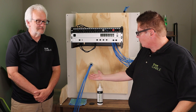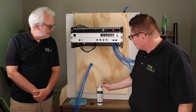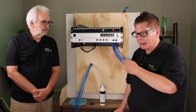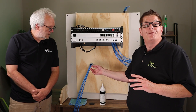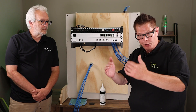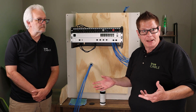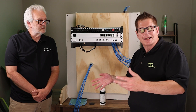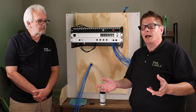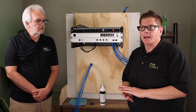So there you have it — we just demonstrated pulling some cabling through conduit. It was a small conduit, but good for demonstration purposes. The main thing was to introduce you to our synthetic cable lubricant, which is critical to making sure cabling doesn't get ruined as you're pulling it through. Also to introduce you to the fill ratios that apply. This video goes with a written blog that has a table telling you how many cables you can get through a conduit for a 40% fill rate. In addition to that: good communication, making sure somebody is at the feed end and somebody is at the pull end, talking back and forth. Never make an assumption when you're pulling cabling through a conduit — you don't want things to go wrong. You could ruin a whole lot of cable or have a big problem and end up taking up a lot of extra time.